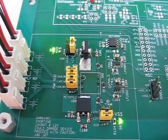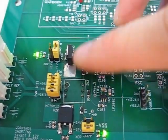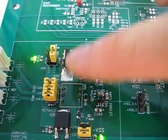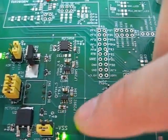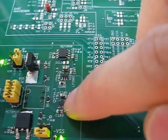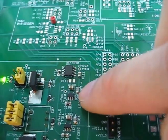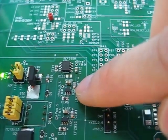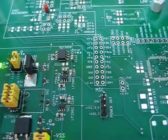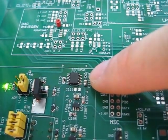I'm just about done with the power supply section. I have a plus or minus 12 volt output for the active components, a 5 volt supply for digital and other stuff, 3.6 volts for the TI Cortex M4 microcontroller, and a 5 volt reference.